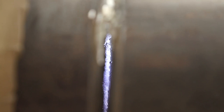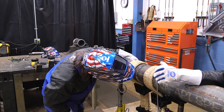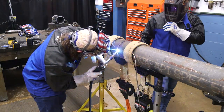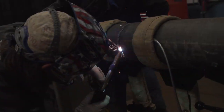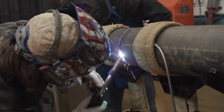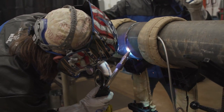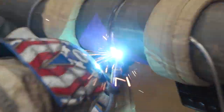Let's clip this wire. Your side's closed up — time to close up my side. I'm having this nice long ramp. Gives your puddle that time to heat up, turn those edges away, tie in, and it's good to go onto the rest of your root. Ladies and gentlemen, good practice is you always want to do your root in quarters — always do it in quarters. That way your pipe won't pull in one direction.